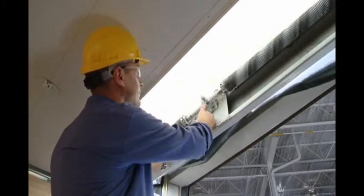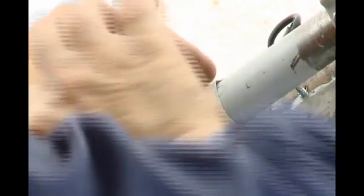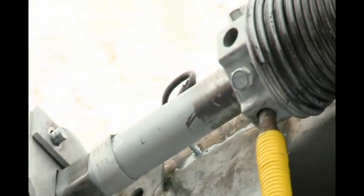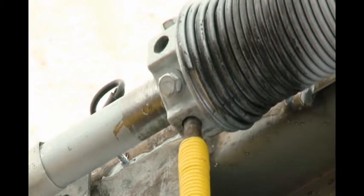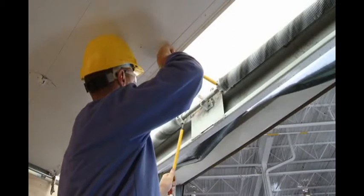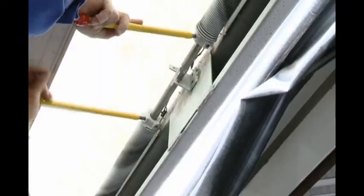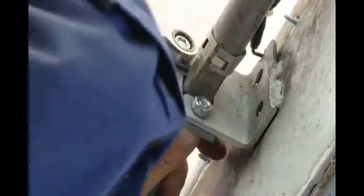Using a half-inch wrench, undo the two nuts on the balancer center bracket located at the midpoint of the Whiting balancer. A new balancer center bracket will replace this bracket shortly. Insert a three-eighth inch diameter rod into one of the round holes on the balancer spring winding cone. Ideally, use two rods to maintain the tension on the balancer spring before the new bracket is installed. Adjust tension as required. Once the desired tension has been achieved, install and secure the new balancer bracket provided in the Command Lift box.